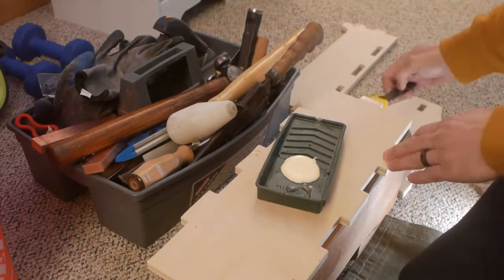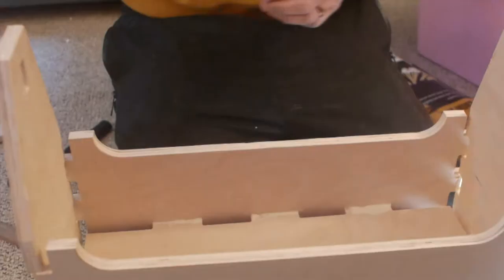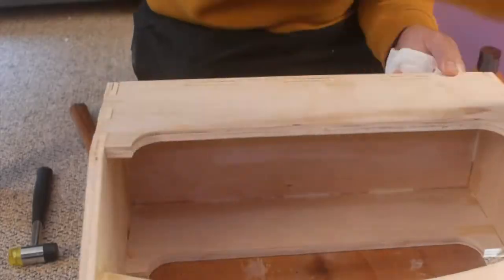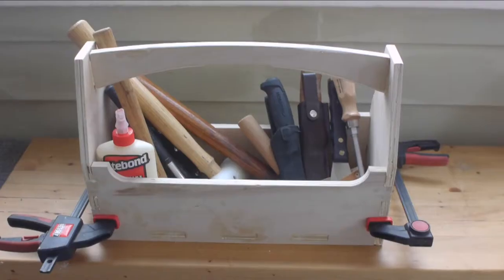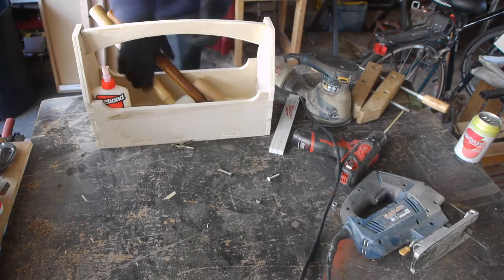Working on the glue-up here — it was too cold to do it outside, and I wish I would have put down a tarp or something; it got a little messy. I slotted everything in halfway and pounded everything in. Third tip: have a squeeze-style clamp that's long enough for the longest edge. I did the short sides with squeeze clamps and that helped bring everything into alignment.